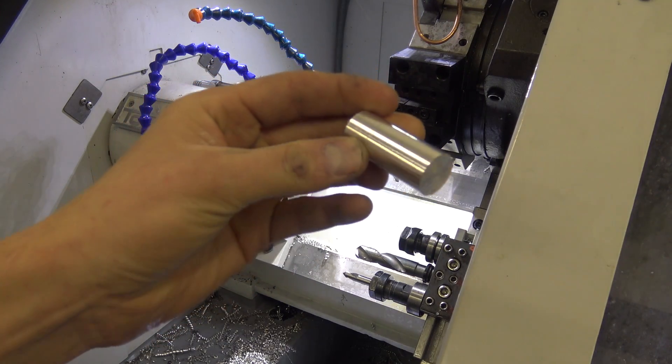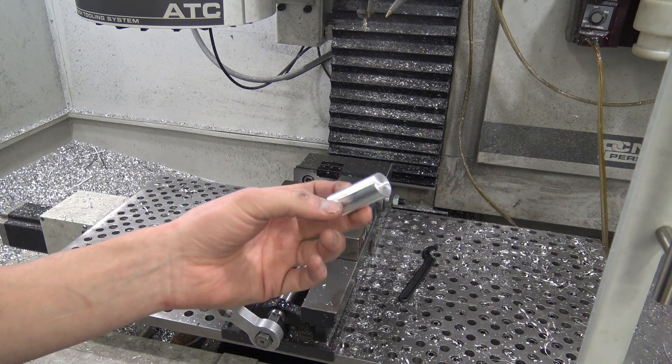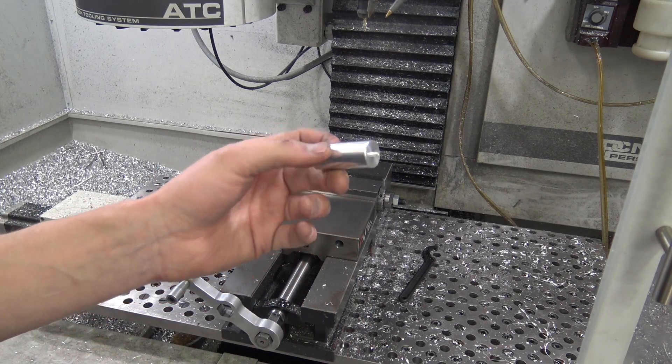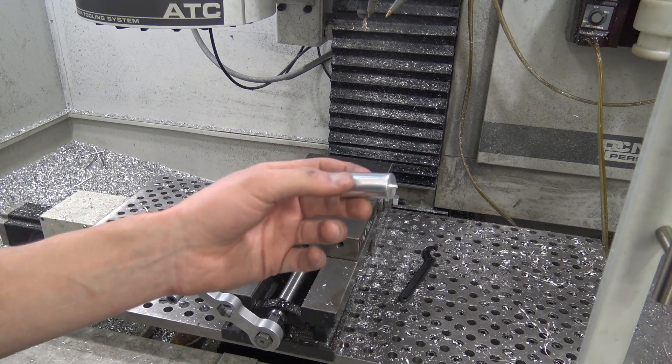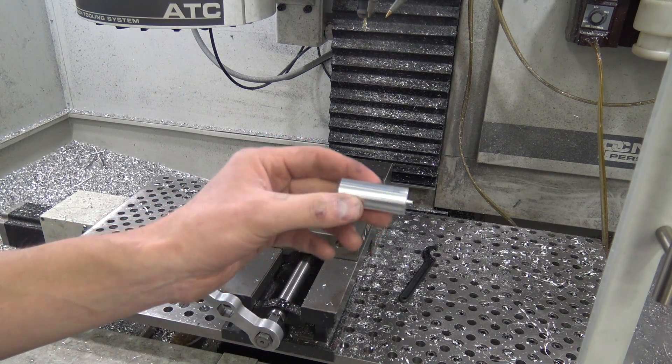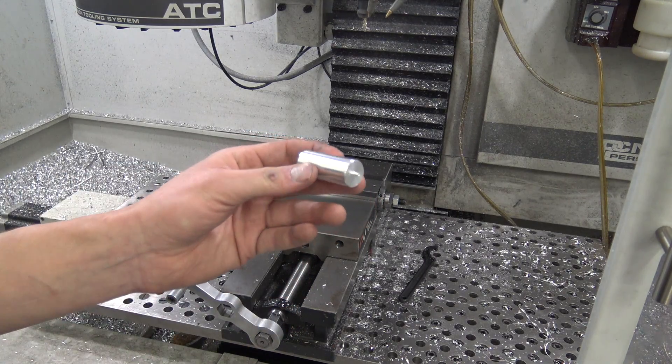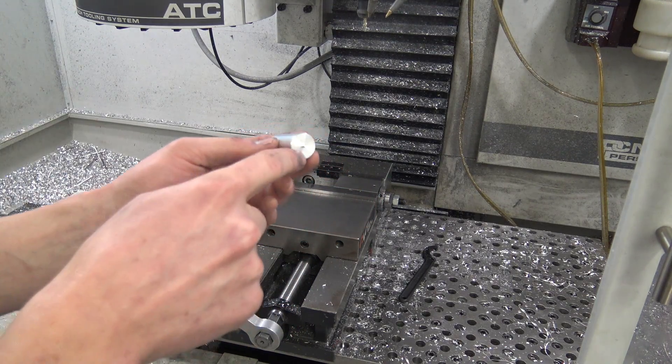Not bad, especially since we turned the cooling off. So we turned on the lathe first because even though the part OD is 0.750, 0.750 aluminum extrusion bar stock has a real crummy surface finish — so that gives us this beautiful shiny finish. It also is one way for me to part it off to a known length, which is a hair longer.